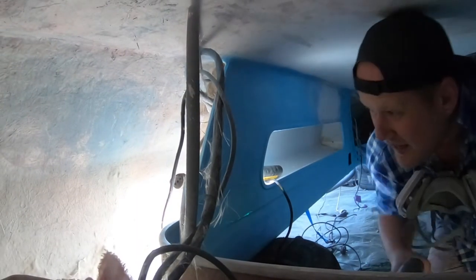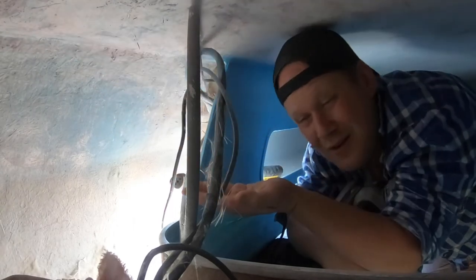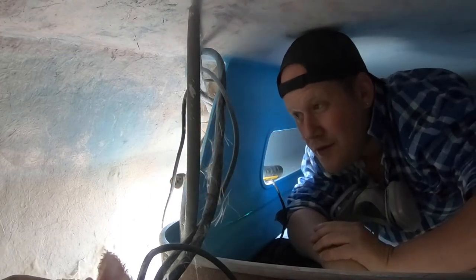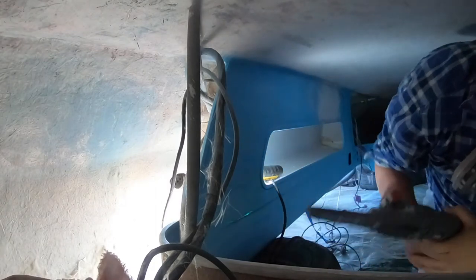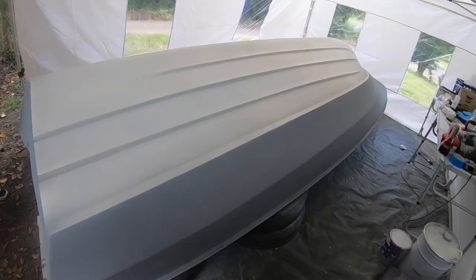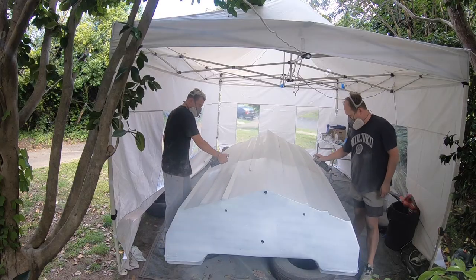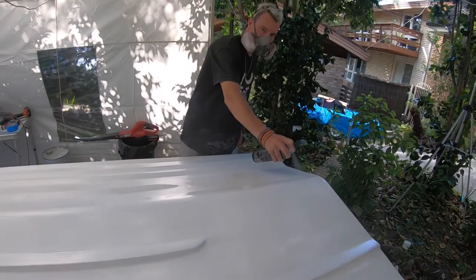Alright, so I'm in here in the hull. While it's upside down it's very hard to fiberglass a roof, but when the boat's turned upside down for these few days, now is the time to lay an extra sheet of glass for strength where the deck cap went on. So it's a bit yucky in here — I'm just going to sand it down a little bit, prime it on. By the time it's done it looks professional. The pipe is good.